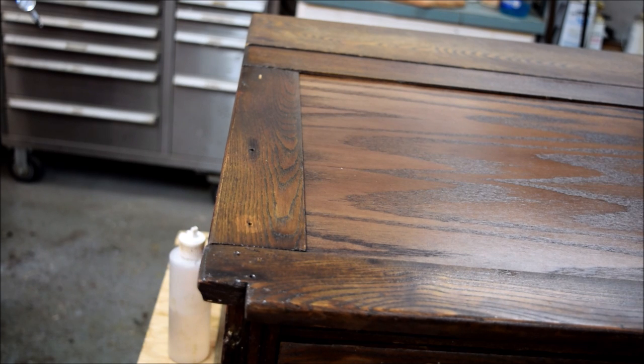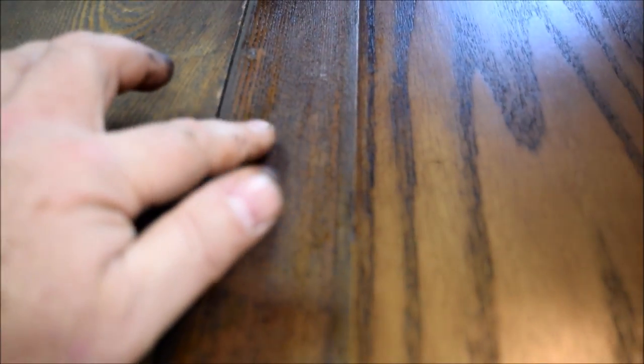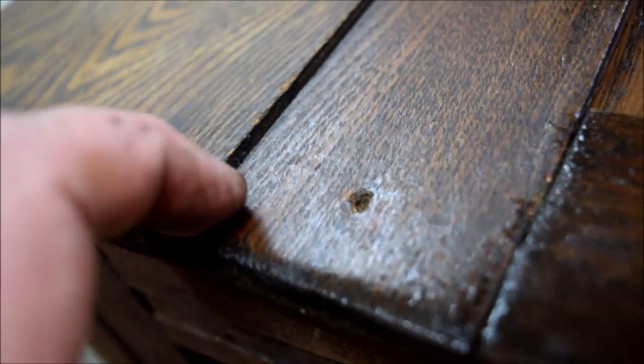So I think I'm going to mount these pieces, and all I'm going to do is just nail back through the nail holes that were there. That's no big deal. There are gaps up here. This piece here is fixed. This is one of the pieces that we had off. And they come together very well at the top. That joint is tight and flat, but the piece is bowed and it drops off down here. So we'll mount that some way that it's acceptable.